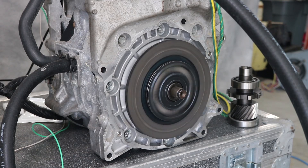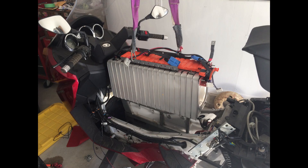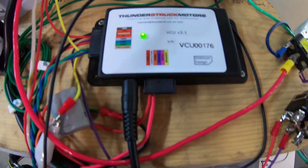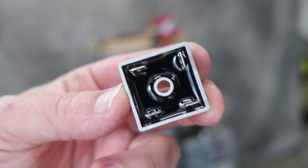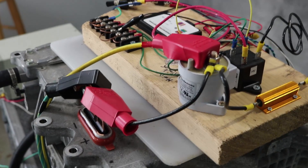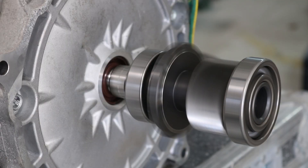Last time we were able to spin up the Nissan Leaf electric motor. I tried powering it from the Nissan Leaf batteries in my electric motorcycle, but it turned out I just didn't have high enough voltage and I got that rapidly flashing LED indicating an error. So I powered it off of 240 volt AC power, run through a bridge rectifier to convert it to DC to run to the DC inputs on the inverter, but among other things it also meant that I didn't have regenerative braking.